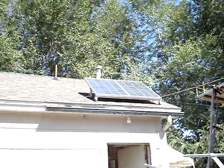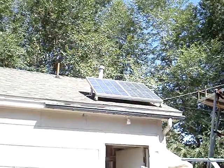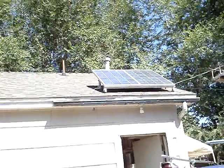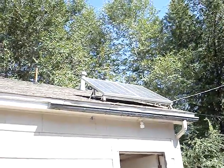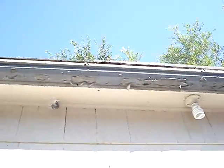Hello everybody, my name is Dave and here is a brief description of my home solar system. The outfit starts right up there — here's where your money is. I've got two 80-watt panels. Each panel is 80 watts, that comes in at 5.3 amps at peak, so together you're rolling in at 10 amps on a good juicy day.